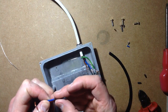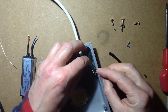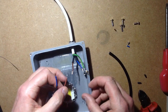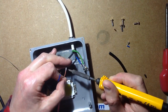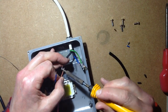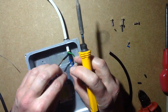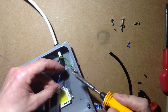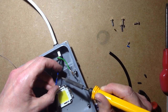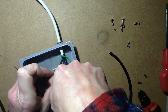So I'm going to slip some thin sleeving over this, and I'm also going to slip some thicker sleeving over the other side, because I like two layers of heat shrink sleeving - it just provides extra protection against spiky bits of solder. So I've tinned those wires and I'm going to reflow them together with the soldering iron. We've got too much pressure and it pinged off. I'll do the same with this one. That one's not quite flat at the end so I'm just going to squeeze it down a bit, just so the heat shrink sleeving can go over it easier.